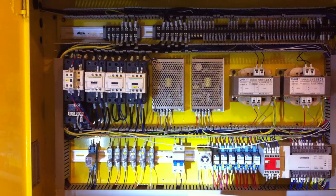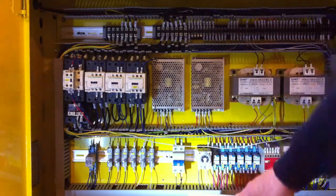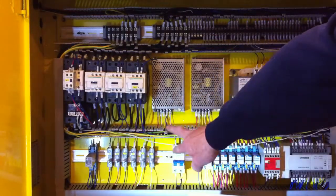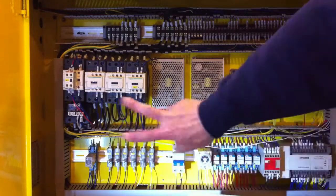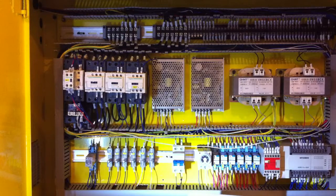So that's briefly the description there. If you want to tell me where to check some voltages and stuff like that, see what's going on, that would be great. I checked all the fuses over here, and there's no resistance going across all the fuses, so none of the fuses are burned out. And that's basically it. I'm going to turn it off now.